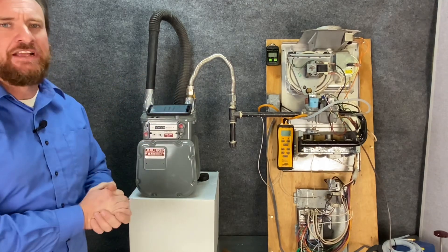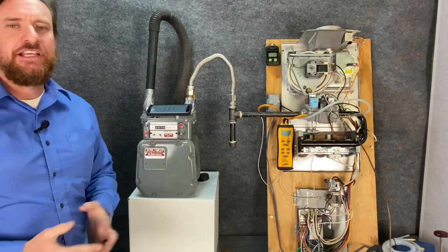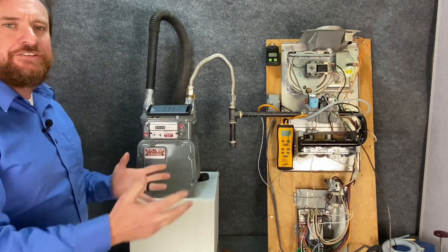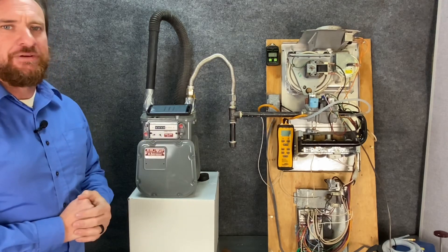So that is clocking your gas meter. When you clock your gas meter for your furnace, you have to make sure everything else is shut off — the water heater, any pilot lights, anything else burning fuel — so that you're only measuring how many cubic feet are going to your gas furnace directly.